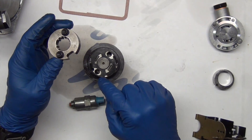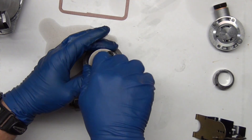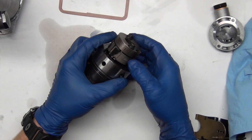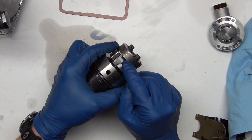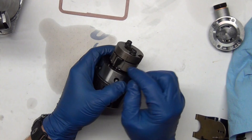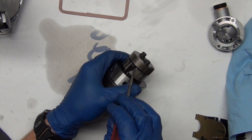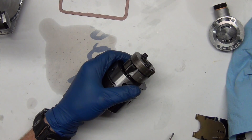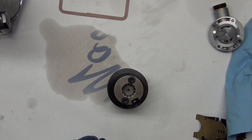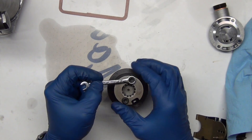So it's this way — I can see a little faint mark right there. I'm going to screw these down and just get them snug but not tight. This is an 8 millimeter 12-point. The way mine has to be set: you can see that little thing is even right there with the B and F on both sides. It needs to be like that, but just a hair over — just a touch of overhang. That's a perfect setting for this one. Let's torque that down.